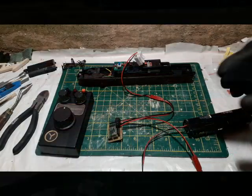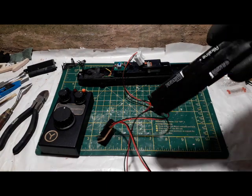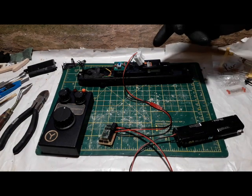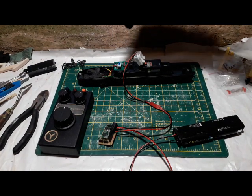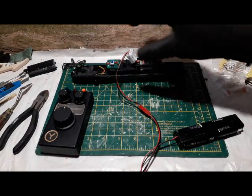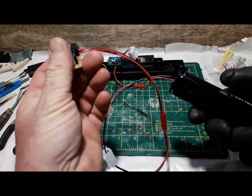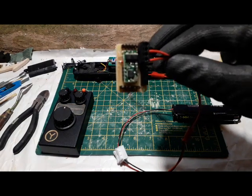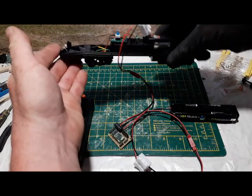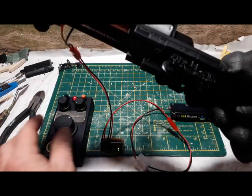What I've got here is a digital remote control system based on Deltang technology. I have the four AA battery case holder. I've cut into this, bypassed the resistors and everything that was in there, and using one of these junction boxes — you'll see it has an M written on it which tells me that's for the motor. Those wires go directly to the motor, and one goes into the power. The receiver is flashing, so when I turn on the controller and give it some power — there we go.